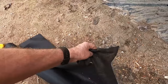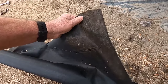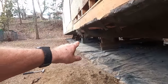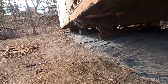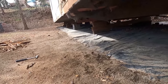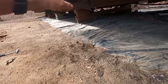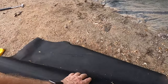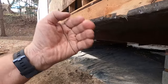It's very similar to the material that's underneath there, and you'll find different materials under different homes. This particular home has some plastic in there as well, but the plastic isn't really all over the place. You don't really want to make it airtight with plastic — you kind of want it to breathe a little bit, and it's going to depend on where you're at. We have plastic on the ground which acts as a vapor barrier to keep moisture away from the home, so your situation may be a little different. I'm just going to use this landscape cloth, run a roll of it along here, and fold it underneath.